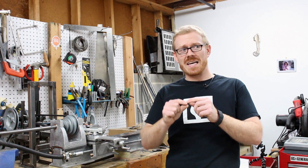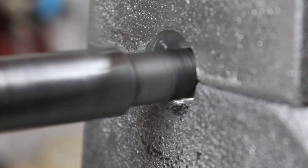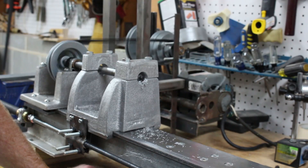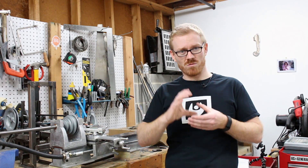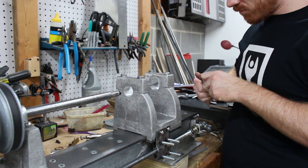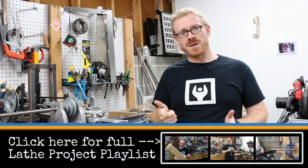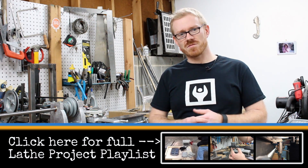I advanced the cutter by about ten thousandths in radius, all the way from slightly over 5/8 of an inch to 3/4 of an inch, then I test fit one of the bronze bushings I had purchased. Continued on up to approximately one inch diameter where I test fit one of the steel bearings that go around the bronze bearings. The steel bearing fit was a little bit tight, but that's a story for another time. In the next video I'll be going into some detail about the bearings for the headstock. I hope this video inspires you to exercise your inner maker. If you liked the video, click the like button, subscribe to Makersize, check out some of the other videos, and we'll see you next time.